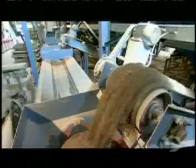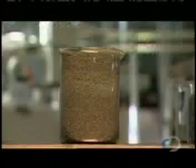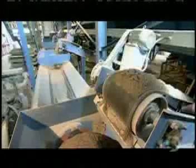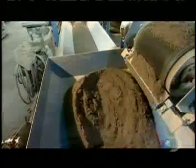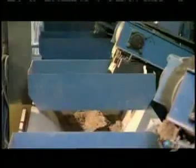To make these pavers, a conveyor belt delivers concrete sand to a weigh belt that weighs the coarse sand as it falls onto it. The weigh belt carries the sand forward, while another conveyor belt unloads stone chips to be weighed. These chips are no longer than 1/8 of an inch. The ratio of sand to stone chips varies depending on the type of paver being made. The weigh belt transports the stone chips forward, along with the coarse sand. Both are en route to the skip hoist.